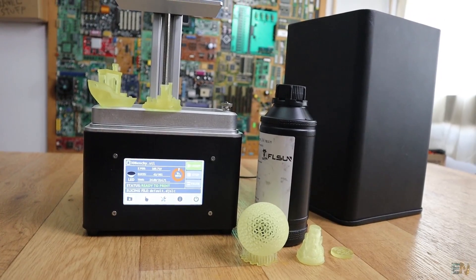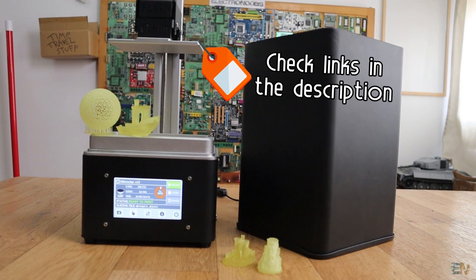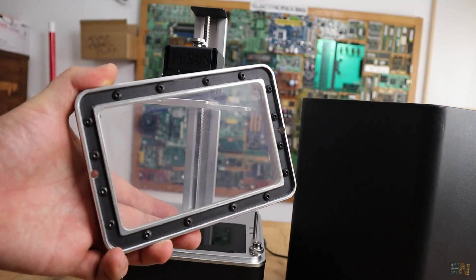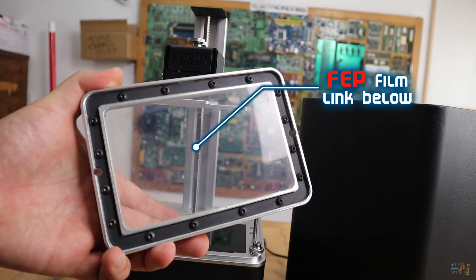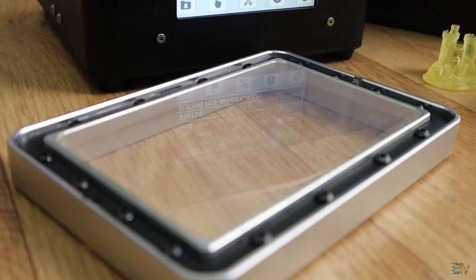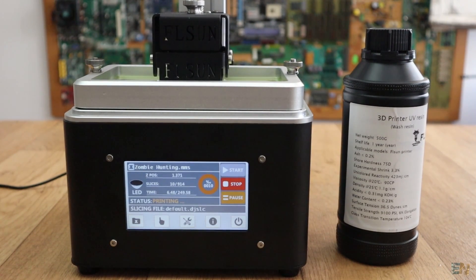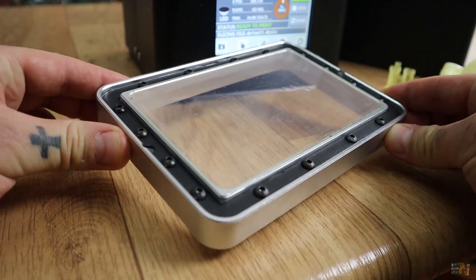So what do I like about this printer? It's amazing. It's not expensive compared with SLA printers, and the finished prints are perfect — no complaints there. The bottom of the bed seems a bit fragile, so never use metal tools with it. A spare part would be nice — it's called FEP film, so you may want to buy one as a spare; links are in the description. All you have to do is remove the screws, put the new FEP film, and tighten the screws back, making sure the film ends up with a drum-like tension. One thing I don't like is that you can only see the print after an hour or so — till then the print is hidden below the aluminum plate and if something went wrong at the beginning you can't tell. Maybe a transparent vat would be a better choice.